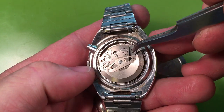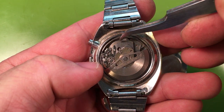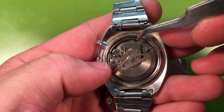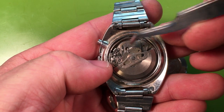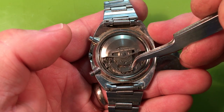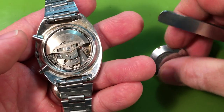Your winding bridge is loosened up a good bit. See this line of brassing right there on this edge? The winding weight is flopping around because these ball bearings are loosened up and it's grinding off the surface of the metal here. So we're going to have to do something about that. It's on both sides, so that's going to need to be replaced.